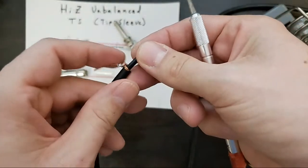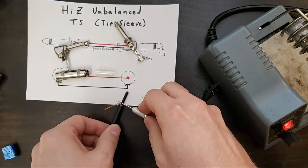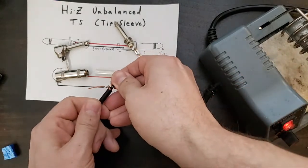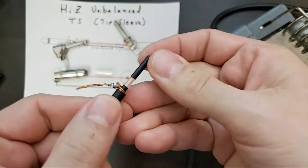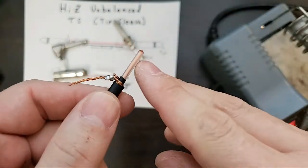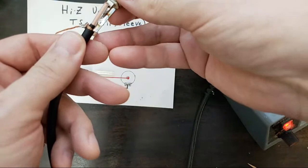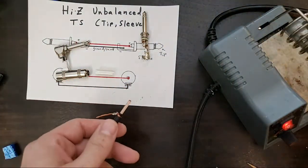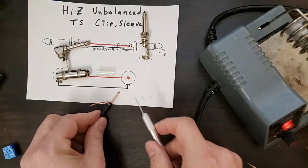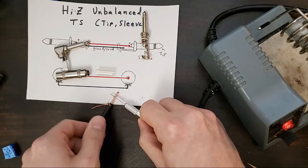Welcome, Tigery. Now, like I said, we're going to remove this conductive layer just gently without too much pressure. And see that? It comes right off. Now, this is another insulated layer. We need to take off about a quarter inch of that. And it's going to go in there like that. So, about a quarter of an inch. Now, we don't want to go too long with this.